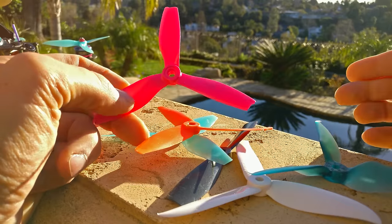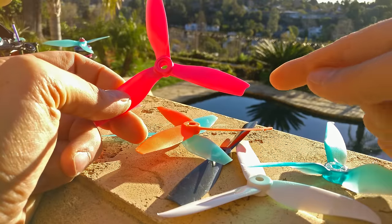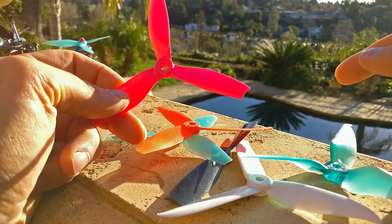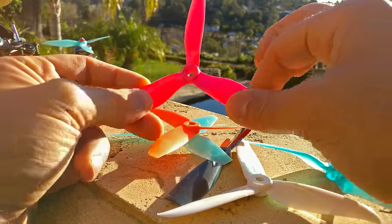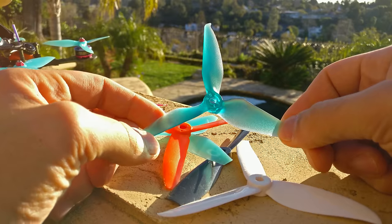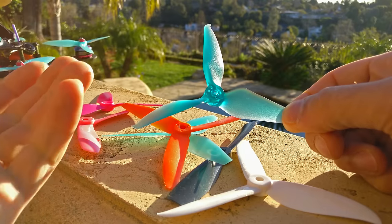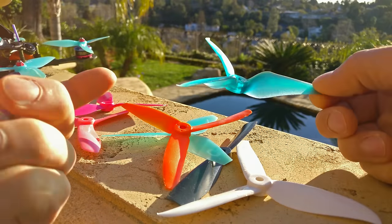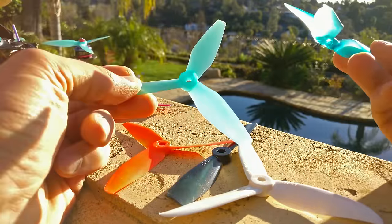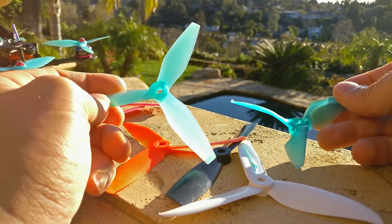This is something I haven't talked about — this blade just looks weird, like somebody drew something on paper. Maybe this end does something for vortex management, maybe not, but to me it just looks like you have two big square points to manage rather than one little vortex tip. This is another HQ blade. So when I look at a brand new prop that a company is touting as amazing, and I see the prop doesn't look nicely shaped and properly tapered, and the scoop doesn't look impressive, and the blade tip looks square — when I don't see these properties that I now understand, I get concerned.